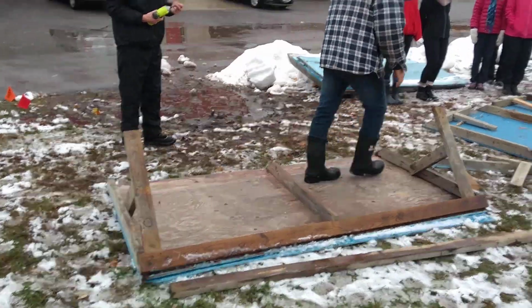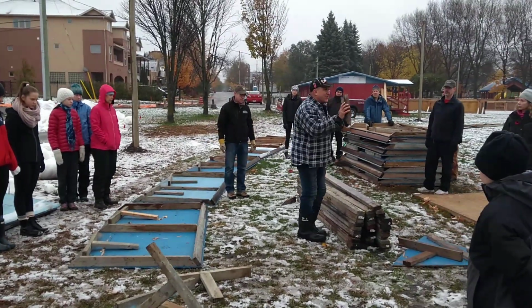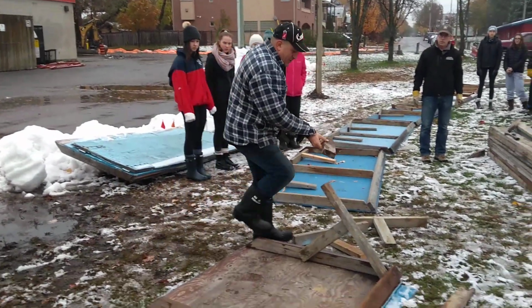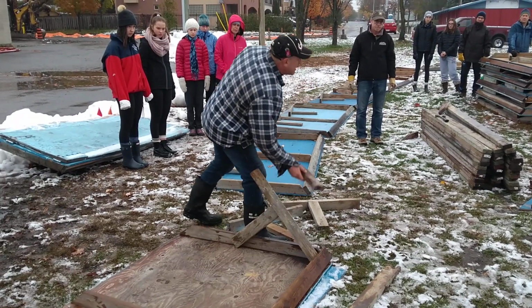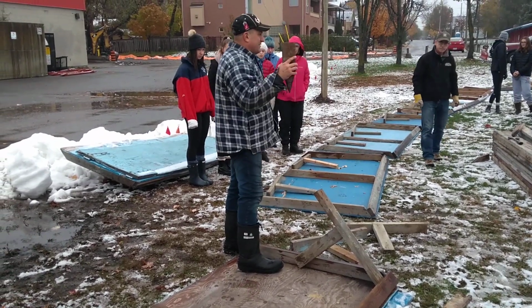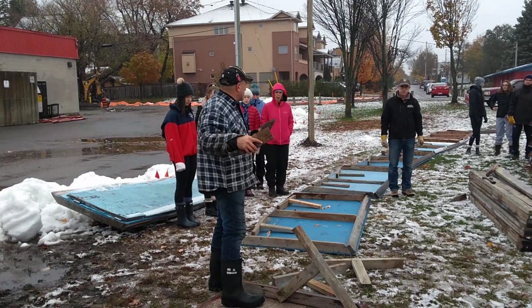There's also some of those little stakes in there that are not actually cut at an angle, they're flat. We need to put a flat one here to hold the 2 boards together to the next one. And then these get dug in the ground to solidify it to the ground. So then when the ground freezes, it holds everything nice and tight. Okay, so there's a number of stakes that gets put up after to hold the boards all together.